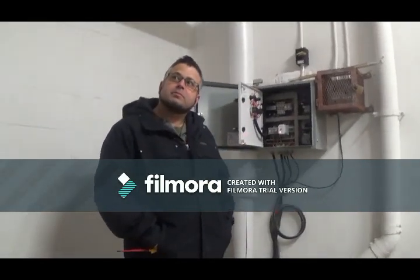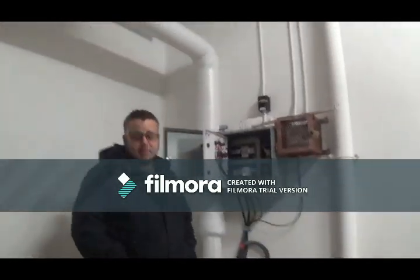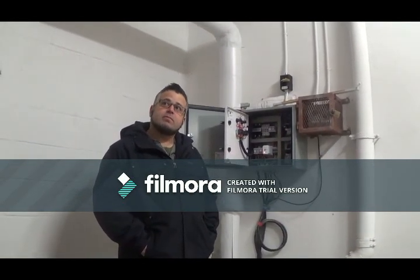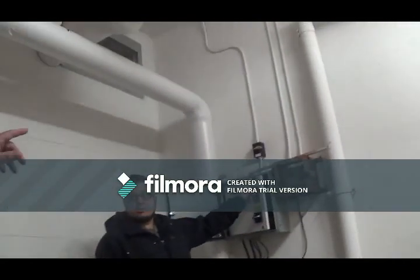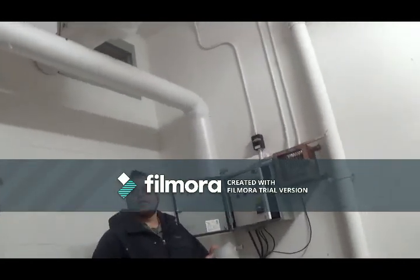So when my guys come in and do maintenance, just curious here, would you say every 3 to 5 months you're going to drain the whole pit down? Just recommend it to check the debris. So it would be a fair assessment that, let's say twice a year, they pull this up and have a look to see where the level's at. If the level's low at the bottom float, would you not assume that everything's working fine? Well, it all depends. If these start tripping, that means your pump's picking up debris.